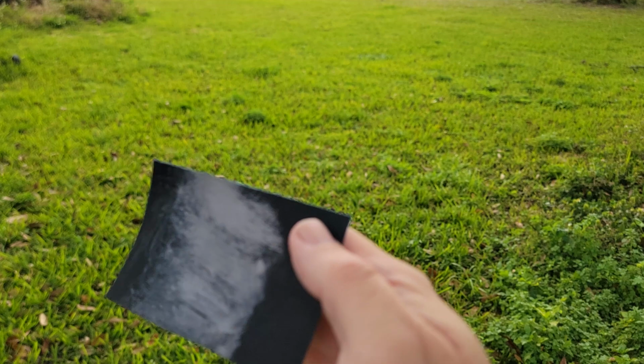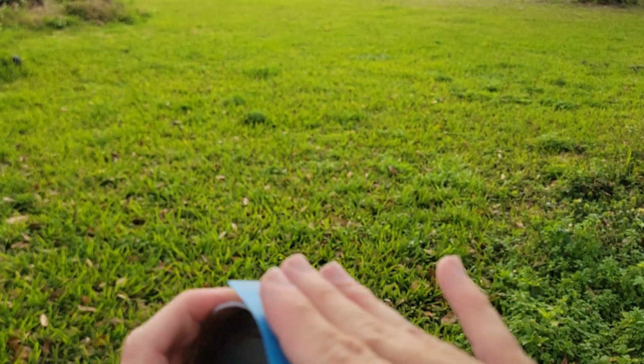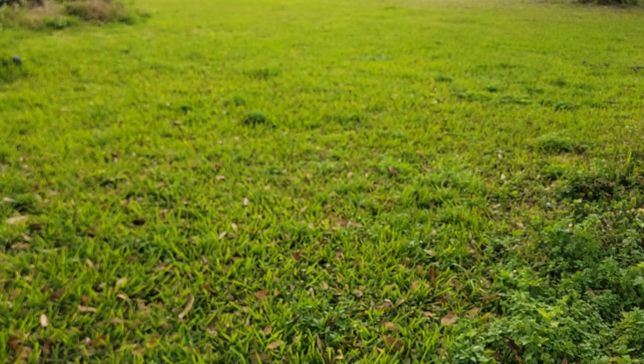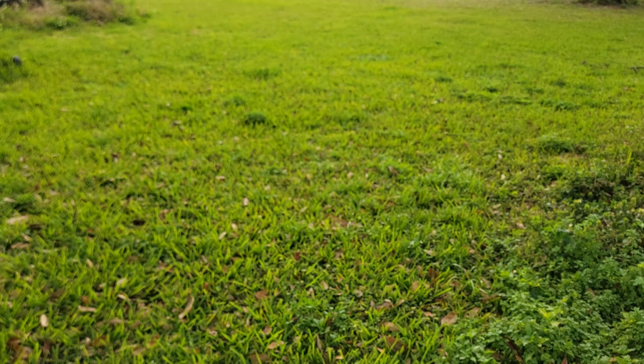Look at that. That's the 220 grit, and I'm not gonna get crazy with this. I'm just gonna use the 220 pretty much to knock off all those bumps. I'm gonna dip it back in the water, clean it off. Yeah, wet sanding's where it's at when you can wet sand. Wet sand when you can wet sand, that's for sure. I am sold on that.